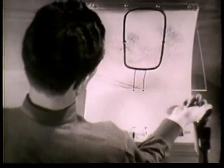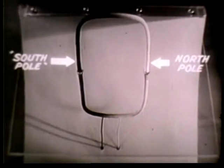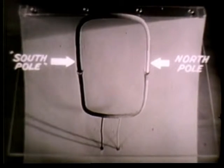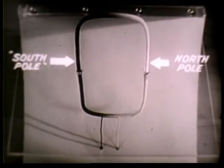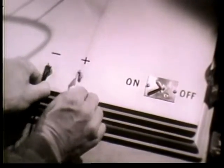Let us take a screen and place it over the magnet, then sprinkle it with iron filings. Notice the pattern of the magnetic field that forms around each magnet and the concentration of filings between the unlike poles. But if like poles are placed together — north against north or south against south — the magnets are pushed away or repelled from each other. With the aid of iron filings, we are now able to see the pattern of the magnetic field of the loop. Like all other magnets, this one also has a north and south pole. Which is the north and which is the south is determined by the direction of the current. So if we change the direction of the current, the poles automatically change positions.